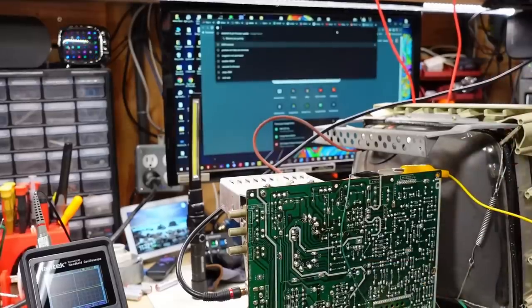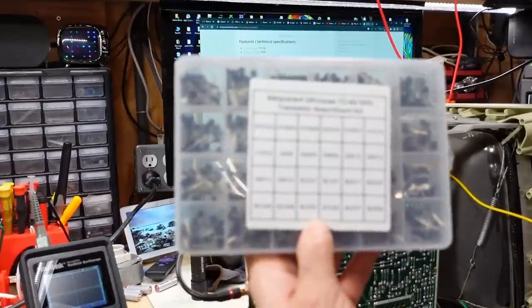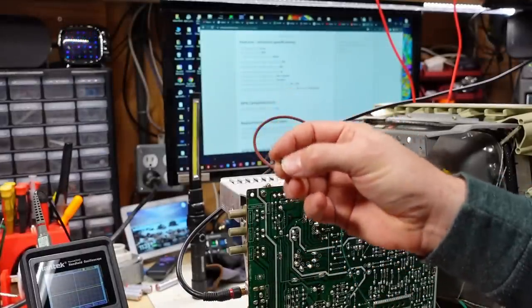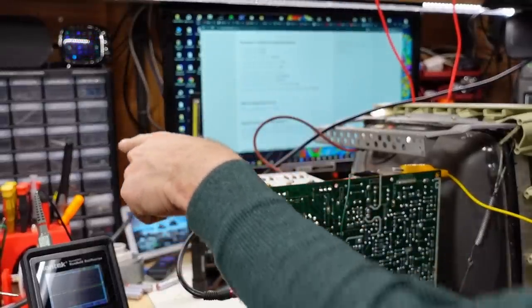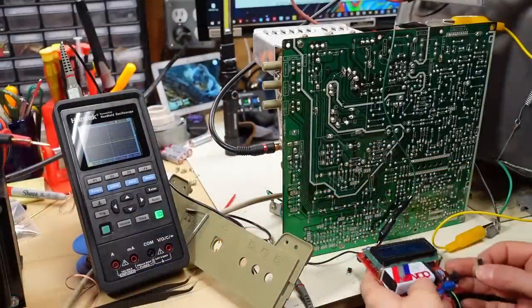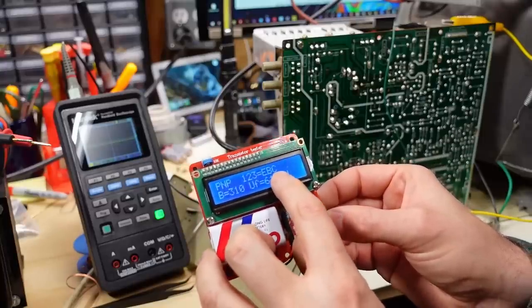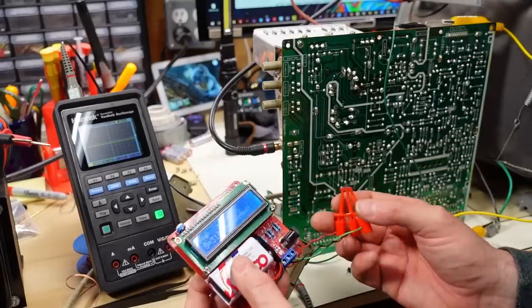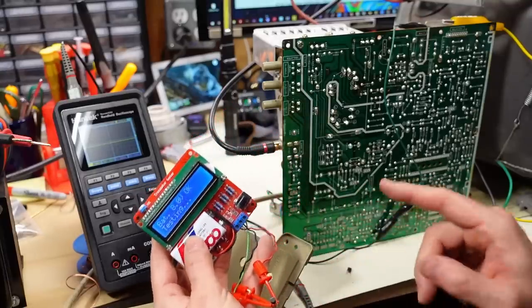Let me go look up what this is - the A733. I'm sure this is just going to be a PNP. Yes - PNP, TO-92 package, 50 volts, 250 milliwatt, 180 MHz frequency. Now I have a little kit full of transistors, but they're all NPNs and I don't have any PNPs, and those aren't going to be the Japanese pinout anyway. I think I have some in my little bin here. I found a PNP. As for whether the specs are compatible, I don't know - I guess we'll find out. It's PNP with a collector-base-emitter arrangement in the same order as what's on the board here. The green wire is the collector, so I need to flip this around the opposite of the way the original part was oriented. The original part had the flat part of the package facing towards the desk.